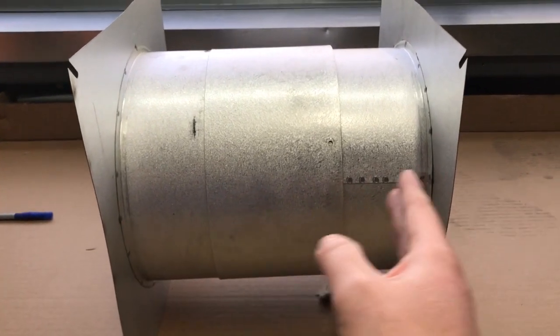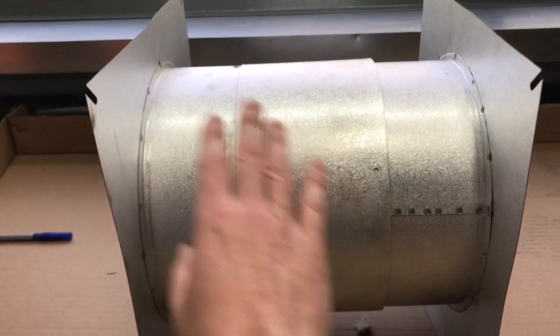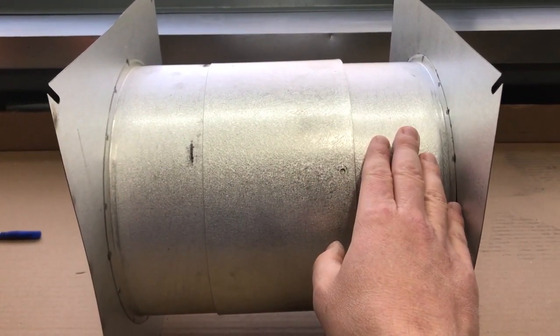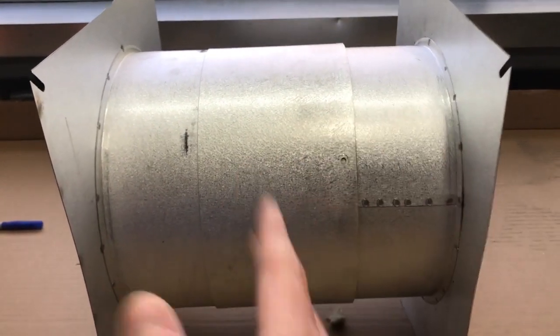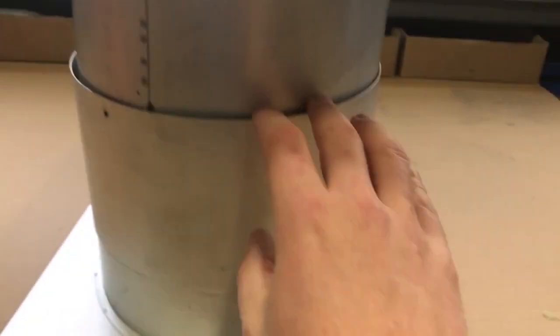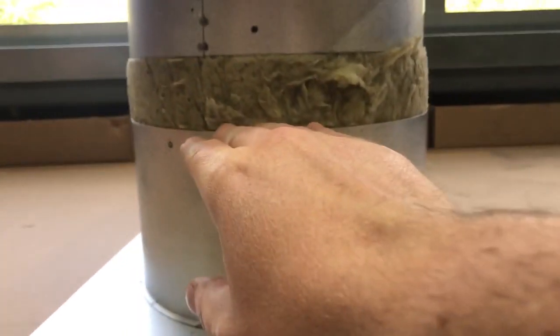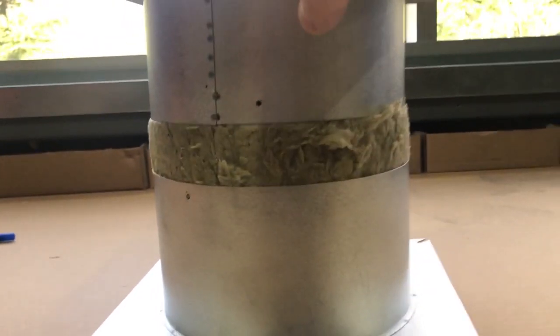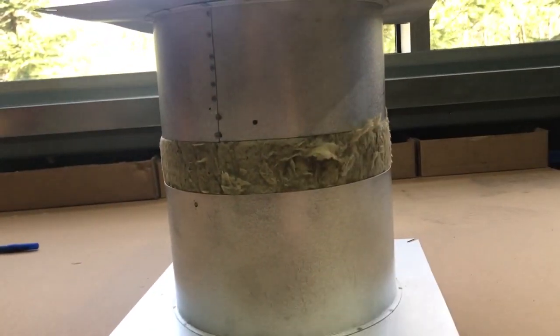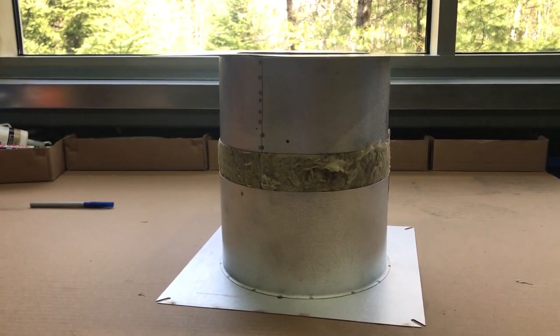Because we wanted to keep the same overall width, we've decided to add a third section, and each of these sections is now only four inches deep. So by the time you've made the adjustment — if you push everything down to minimum — you can get just four inches of wall depth. You would cut away this insulation, push this other section all the way down inside the other two, and you would get a wall thimble that's perfect for a 2x4 wall.